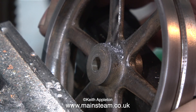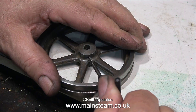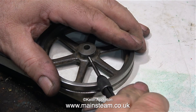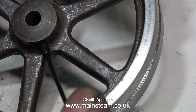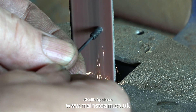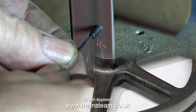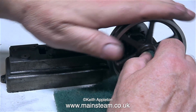I'm holding the flywheel at an angle in the machine vise. And even though it's not clamped securely in the drilling machine, with the pressure of my fingers on it plus the fact it can't rotate, makes it a very safe job. The next part of the job is routine — I'm threading it very carefully using a 4BA tap and fitting an allen head grub screw. The 4BA grub screw is a bit too long, and my preferred method for shortening grub screws is on my 1 inch belt sander. And in no time at all, it shortened the grub screw to just the right length.